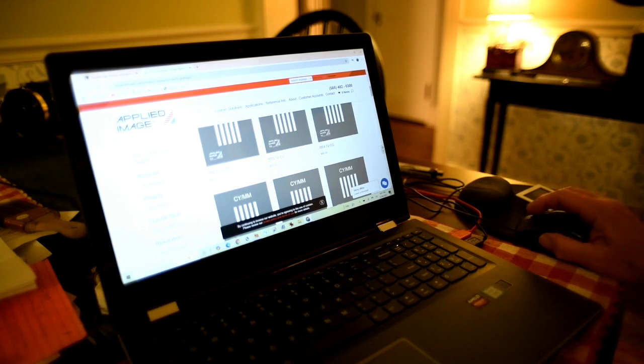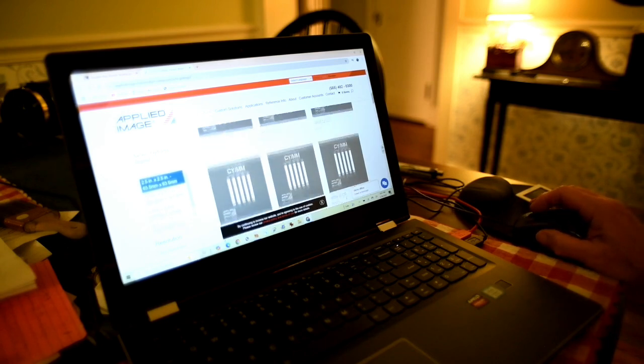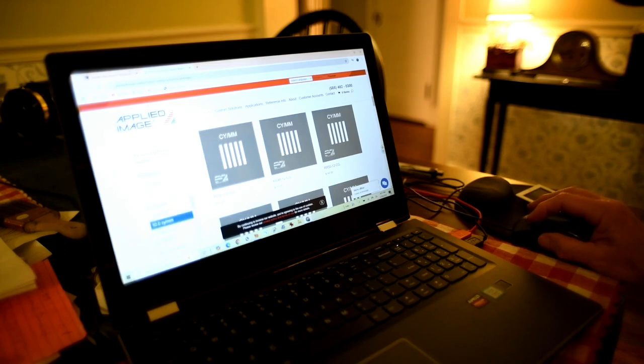Excellent. And they have overall different sizes, 2.5 inches, 4.5 inches. You don't need anything that big. 2.5 inches. They might also be able to do custom sizes for you. The other thing is, I said 133 lines per inch. They have resolution, and 133 lines per inch is right around what they call 5 cycles per millimeter. You can go 4 cycles, but I would recommend the 5 cycles per millimeter. Now if you get chrome etching on glass, you can see that it's starting to become a little bit expensive.